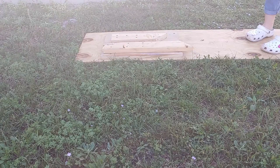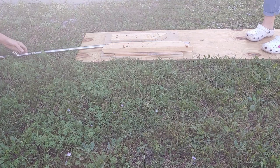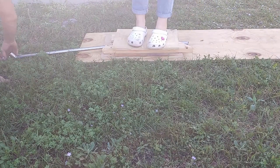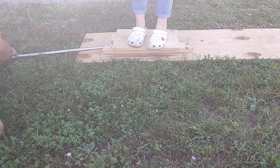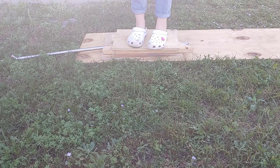So with the hot metal and some really thick gloves, transfer the tubing over to your pipe bender, and then have somebody stand on top of the pipe bender, preferably where the pipe is, so that the 2x4s don't come out. I had to put some stakes down so that the entire thing wouldn't move, and gently bend away. If you do it properly, you'll come out with little to no kinking whatsoever.